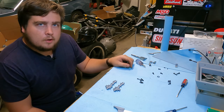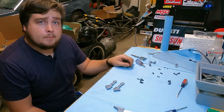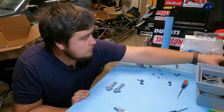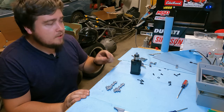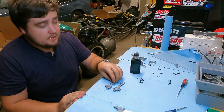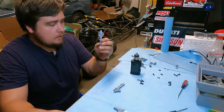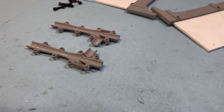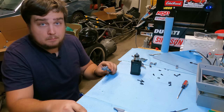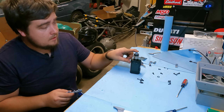The smoke was actually one of the harder things to do — not because it's actually difficult, but because even though I'm 23 I don't really want my parents to know that I know anything about smoking. So I actually have never bought one of these before, but here it is. That will be our smoke generator for putting into the stream. And for the other side I have a regulator and some hose, and this is a Venturi — well this is half a Venturi, this is a full Venturi. Ideally these will stick together and pull vacuum. I'm going to put compressed air through this and hook the Venturi end to this.